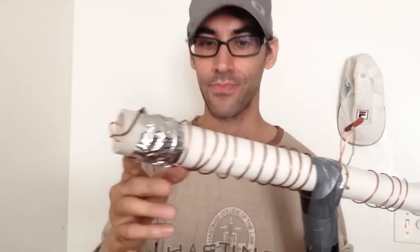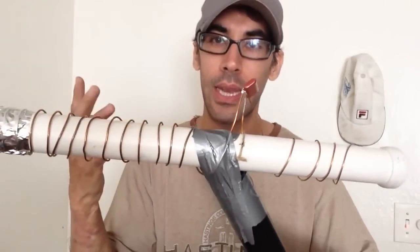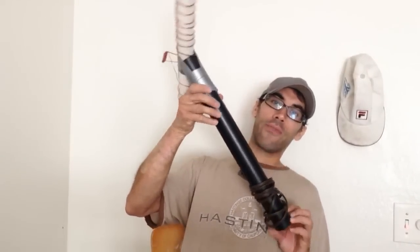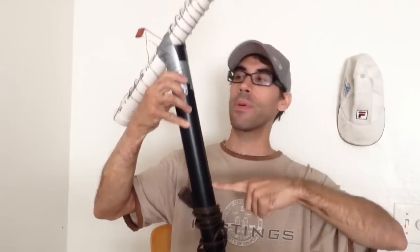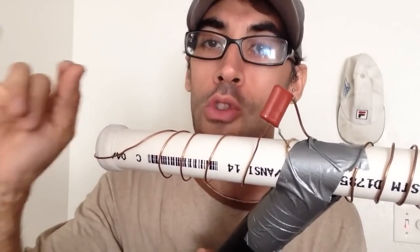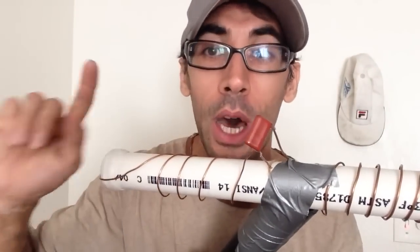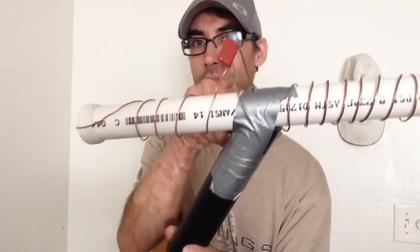It's very simple — 1.5 millimeter copper wire, it can be with or without enamel coating. The windings are approximately 20 turns on one side and five on the other side, but you can play with it. This is the overall device — very light, very simple. Everything is mounted on a PVC pipe. We have a center cable connected, and one thing to say is that the capacitor is polyester. Don't use any electrolytic capacitor — the polarized plus-and-minus type. Use ceramic or polyester, but not electrolytic.